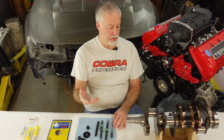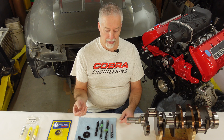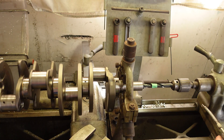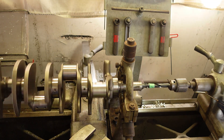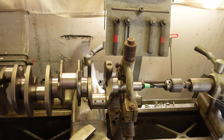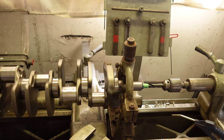I'll put the video up now and show you what I did on the lathe. This is the only time I've ever done it myself — I usually just have a machine shop do it. It was actually pretty easy once you set up the steady rest. So here you see I'm starting with the 9/16" drill, basically just pecking away at it.